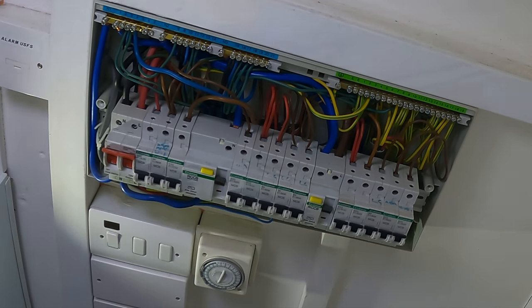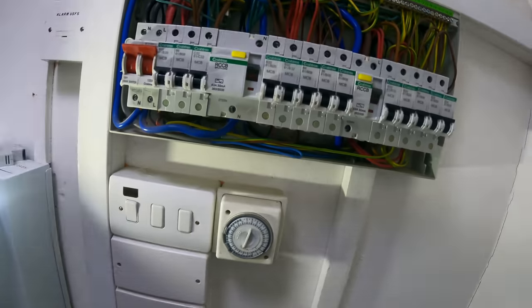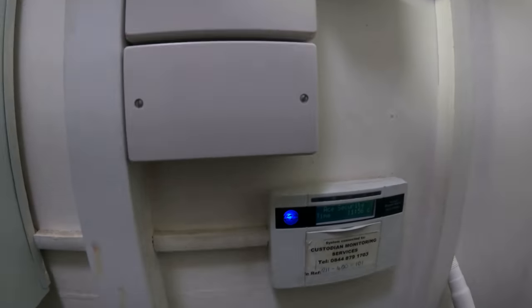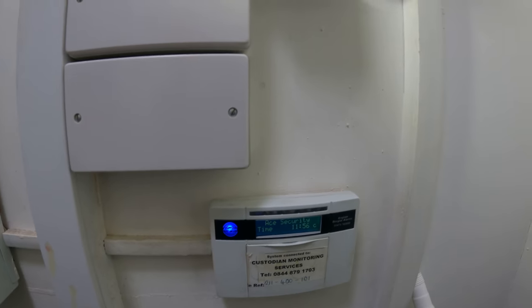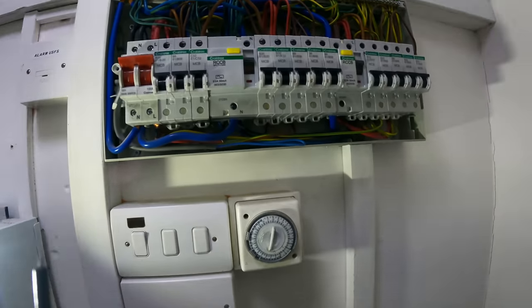All of the cables were live coming out of the circuit breakers — all the outgoing terminals of the MCBs were live. I also did checks from the neutral bar to make sure there was voltage not only line to CPC but also line to neutral, which there was. So I started to wonder: am I going mad? What is going on? Maybe there's a junction box somewhere, or maybe a damaged cable on that twin-and-earth coming into that socket.